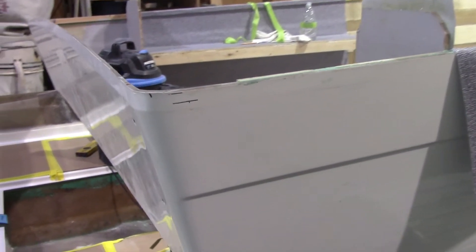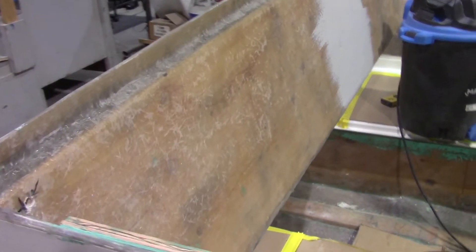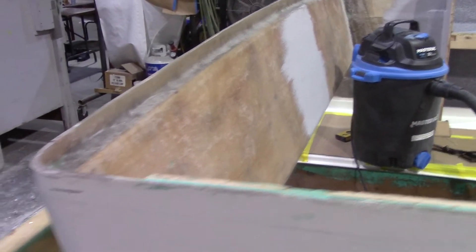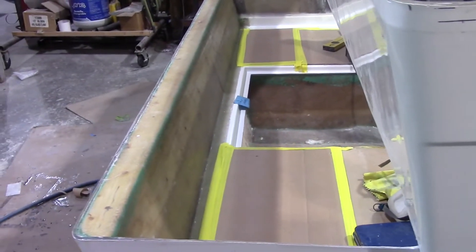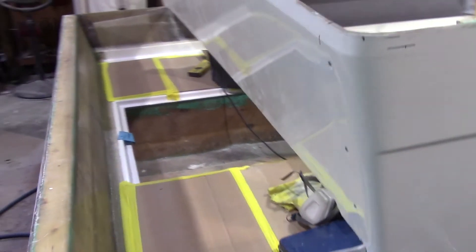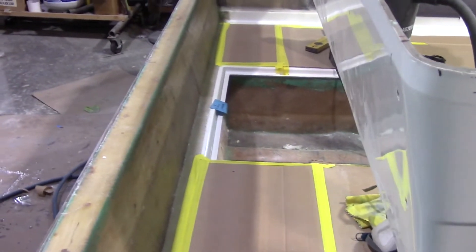The process is to lay up this 24-foot hull. We don't need as much plywood in the transom because there's nothing hanging off the back of it, so we've got one layer of three-quarter inch. People probably question why we're using wood instead of composite — well, we've been using wood since the beginning, the 70s, and it's worked well.